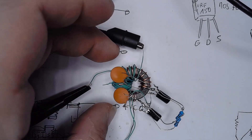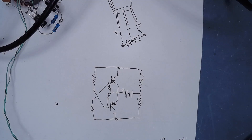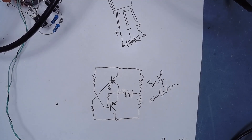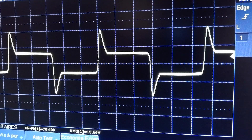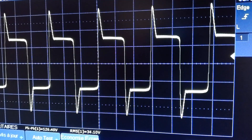Here in front is the little oscillator — it's a very simple oscillator with a natural oscillation, called a self-oscillation circuit. Despite this simplicity, it provides a very nice square wave without a dead time, and for driving a circuit like that it's perfect. It's very sensitive to voltage variation: the frequency rises when the voltage rises — voltage and frequency increase at the same time from the output when you feed it with a higher voltage.